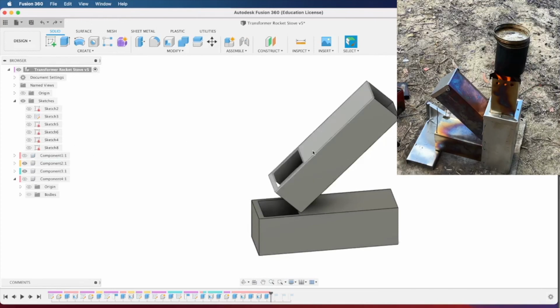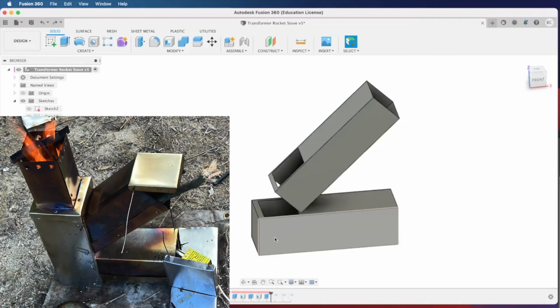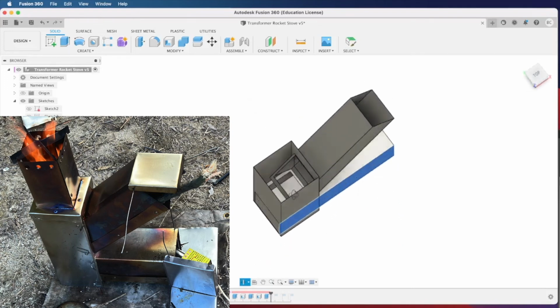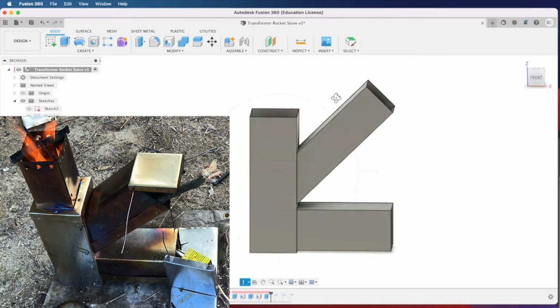So you put in the wood at the other end of this tilted pipe. The wood will slide into the combustion chamber at the bottom and mix up with the air and start burning, like the diagram you see at the left. To allow the tilted pipe and the bottom pipe to insert into the big main pipe, we have two square holes, one at the end, one at the middle, open up for them.